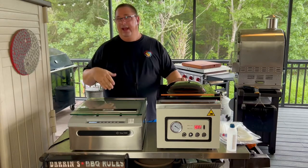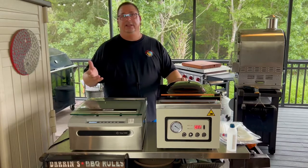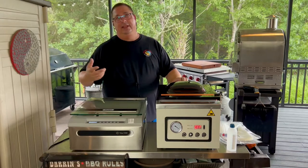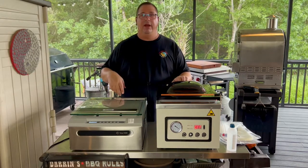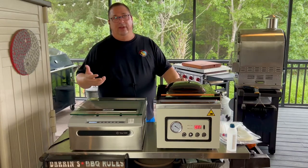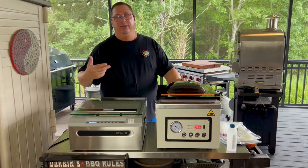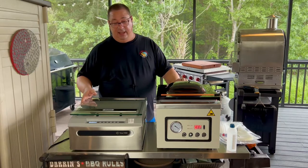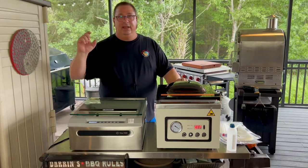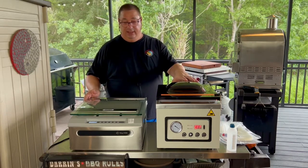The tenth slot on the VAC 100 is actually an oil cleaning function for the pump, which the Meet Your Maker does not have. You run it at least once a month depending on usage — it runs a cycle to get as much water out of your oil and pump as possible, saving your oil and protecting the pump from moisture and rust. This feature will actually let your pump last a lot longer. The Meet Your Maker does not have that.